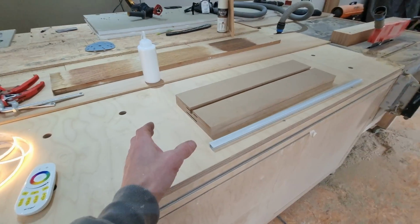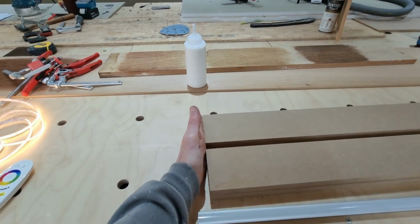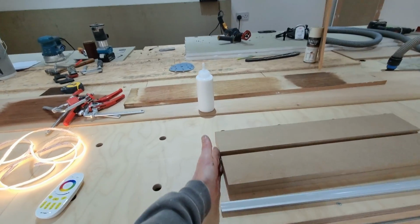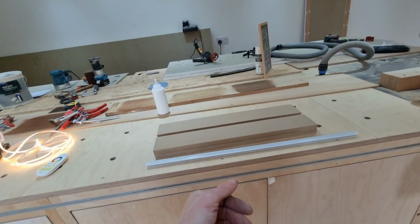Also in length, you want to do the same. You want to leave yourself a little bit on either side, I would say, especially if you've got this butting up against the carcass side. If you're making alcove units, then these have got to be completely straight and true. I would suggest just leaving 10 mil waste in length to allow you to trim 5 and 5 at least.